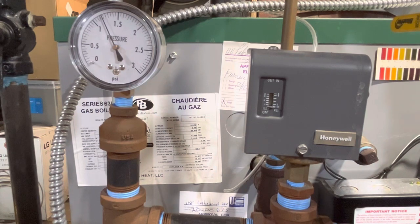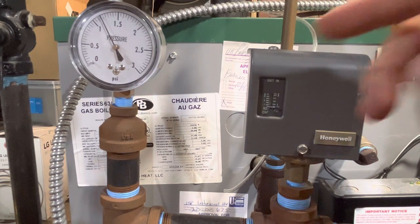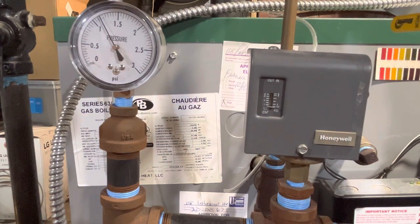It's making your house warmer a little tiny bit faster because as the pressure goes up, the temperature of the steam increases, right? But it's not very much. It's a few degrees. So instead of 212 degree radiators, you might have, I don't know, 215 or 217 or something. It's not going to make that much difference. It's far better to have this thing sitting here not burning fuel like it is right now.